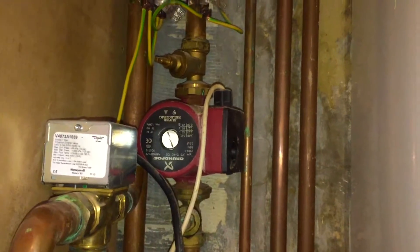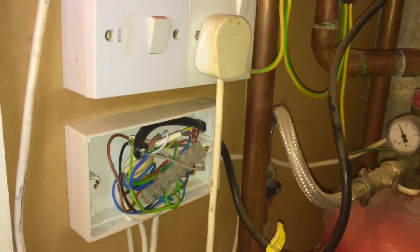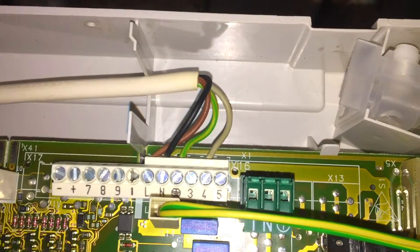So a few different things were odd: S98 on the boiler showing the pump was running, tepid cylinder, and power on the off-wire when the timer had both lights on for demand. I opened up the controls cover - this is why we get the pump symbol without the pump running - it's quite simply not wired into the boiler. All we have in there is live, neutral, earth, and switch live. I followed the boiler cable across and guess what's not earthed? The boiler isn't earthed. So obviously I'm going to have to sort that out. The pump also isn't wired into the boiler as it should be.